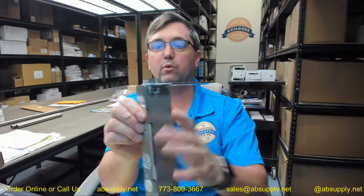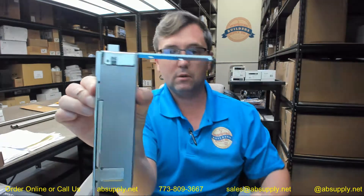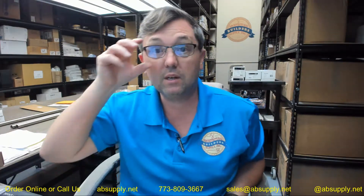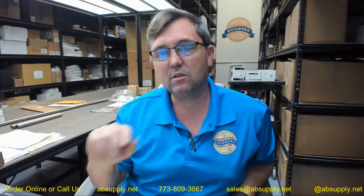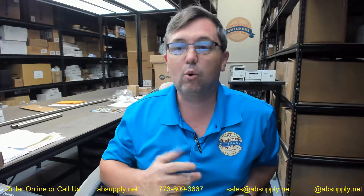That is what you are going to look like when all is said and done — that is the real deal. You are going to want the dust box because if it is a fire rated wood door, you will have the intrusion of particulate slowly moving through there over time. Some people will call it an asbestos door, a core door, a drywall core, or gypsum. It is a mineral core product — something that basically has no combustibility to it.